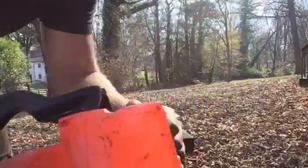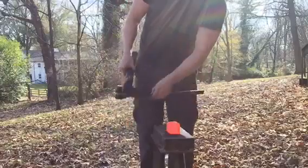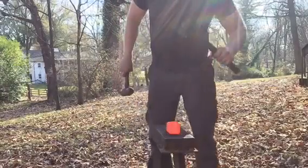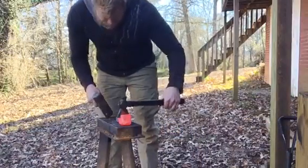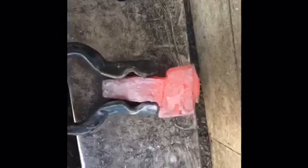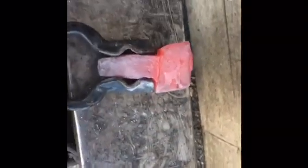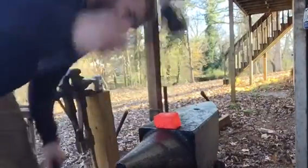There's way too much material here, so I'm gonna go ahead and cut off the excess. About three inches should do it — should be able to get it on this heat. Here's where we're at on the stump anvil: excess is cut off. As you can see it's still sitting crooked on top, so next thing we're gonna do is just drop it into the hardy hole and then work from the top getting it flat, square, and everything lined up, and then we'll get the face welded on.